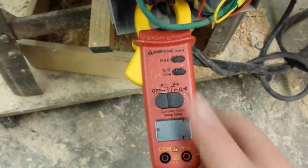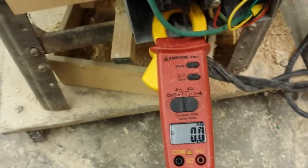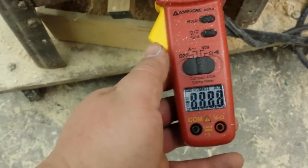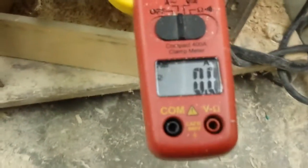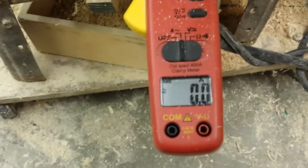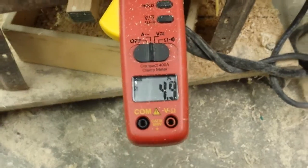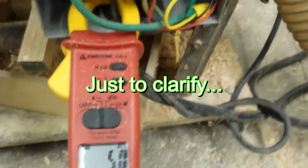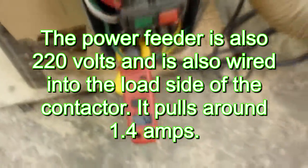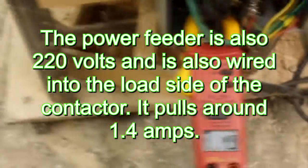Here's a piece of scrap — I'll start it up and we'll look at the inrush current. Okay, here we go. We'll let it coast down — 1.1 amps that time. Alright, we're hovering at 4.9 amps just running the dado, and I'm going to take this piece here and watch the amps as I run it through.